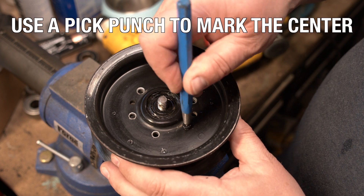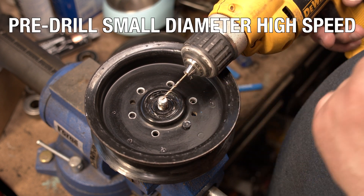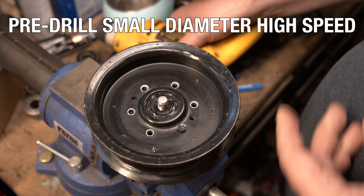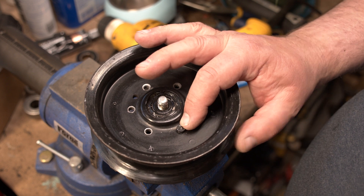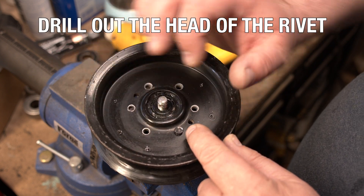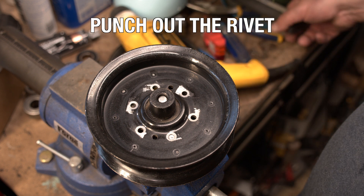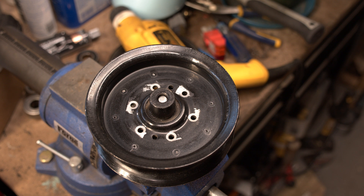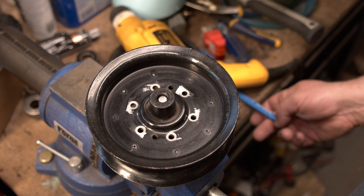You can see there's a little hole in there now. Then you pre-drill with a very small drill — you go in here and you don't drill very deep, only as deep as the rivet is sticking out. Then you drill a bigger hole, this size or bigger, until the head of the rivet slips off. Once the head is off, you take a little punch from the other side and punch it out. The rivet fell out — it is gone. You can replace it later with a screw or a new rivet.